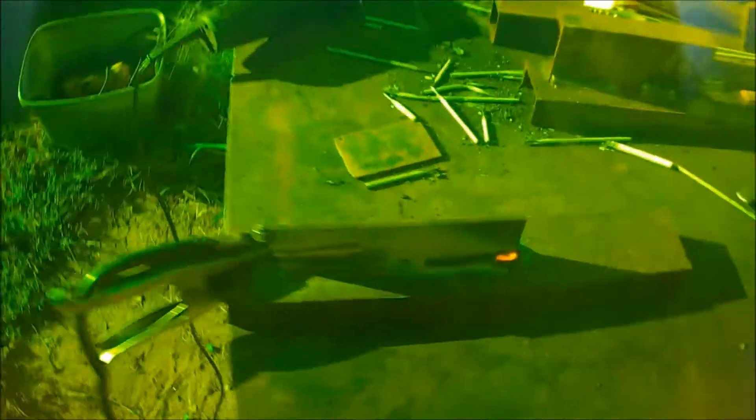I don't go very wide — it's twice the width of the rod. Just drag that dark line, which is your puddle, right along with you. You're in no rush — you want a good weld.